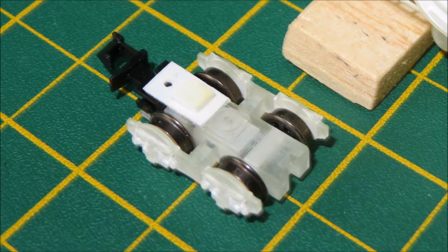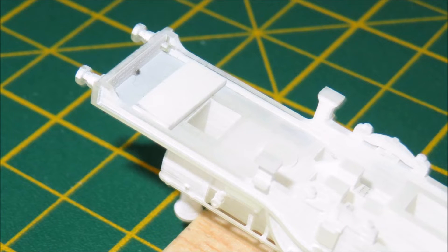What is of particular note for these engines is the front bogies. As you can see, they're intended so that a regular NEM N gauge coupling can be fitted. This can simply be glued straight on, but for extra strength a small shim of plastic can be added on top. You'll also notice a small square of one millimeter thick styrene plastic added on top, which marries up to a shim of similar one millimeter thick styrene underneath the running board between the frames. The two parts rubbing against each other give an easier surface, ensuring that the top of the bogie is free from the bottom of the running board. You might also find it useful to have a second piece of plastic so both wheel sets on the front bogie have support above them. This is mainly a case of experimentation but appears to be highly effective.